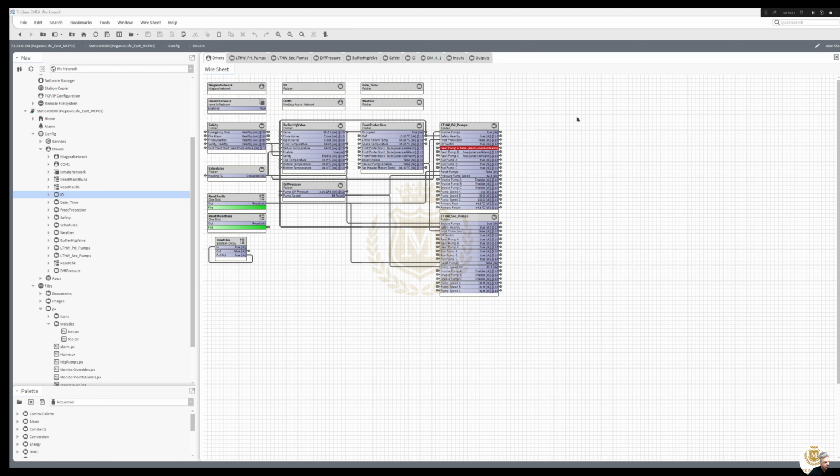So these are the drivers, the logic, sorry. So the safety, buffer heating valve, frost protection. Not that the space temperature frost protection will work, due to the space temperature being in the boiler room. So we won't be really using that. It runs 24/7 on the time clock anyway, because it's providing heat to the HIUs, which also is the hot water for the apartments as well as the heating. So the system will run 24/7.